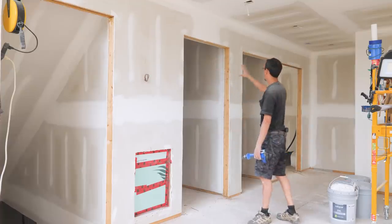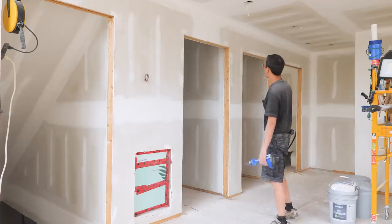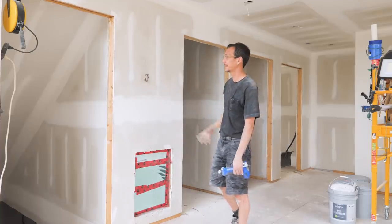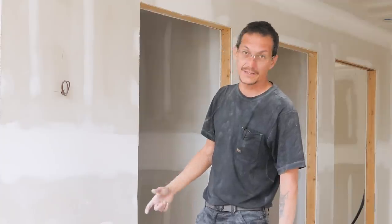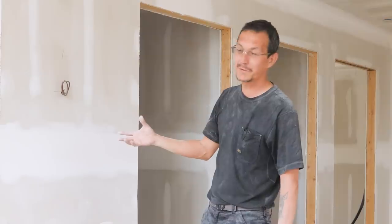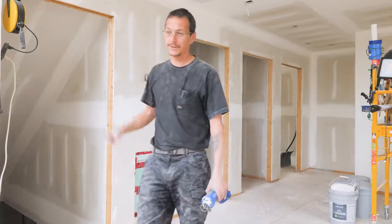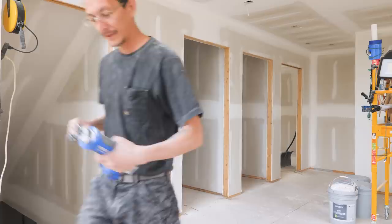But all the exterior walls, the exterior of the rooms that you see, we can do 4-inch casing, make it all look nice for visitors to see. When I designed the house, I didn't design it for the size of the casing. I just tried to maximize the room space and make the doors all big enough to fit wheelchairs through. So that's a lesson learned. When you're designing your house, make sure you allow for the width of your casing.